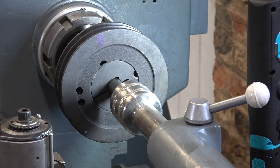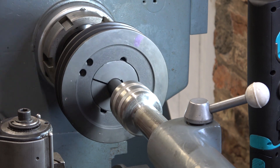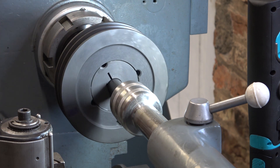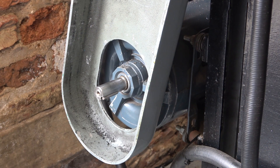Hopefully you can see the mark. What I can do is rotate it a number of times, freely rotate it and see if it stops in the same place each time. So the conclusion here is that this method has too much drag to find a heavy spot on a pulley such as this. Or if the pulley is actually in balance, that's another possibility. Well, if the pulley is out of balance, it's only by a very small amount, I think.